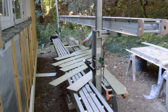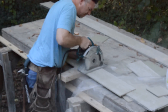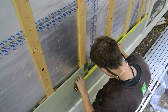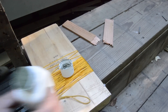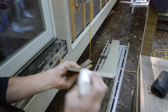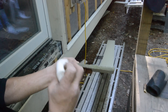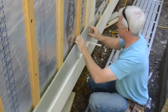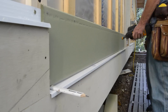Then he gets to work cutting starter pieces. While the guys install the starter pieces, they can get numbers for the finishers and holler them down to Dave. Cut edges need to be sealed before installation — this is a primer paint mixture provided by the siding manufacturer. Install the first piece of siding about a quarter inch above the base flashing. This lets water drain out and also acts as a capillary break.